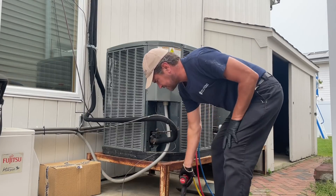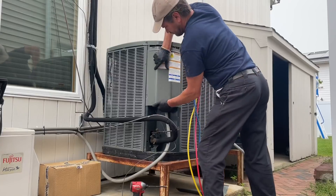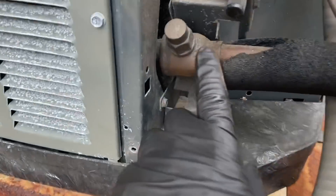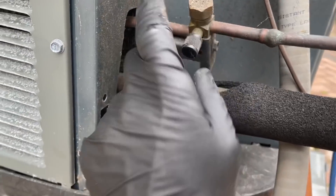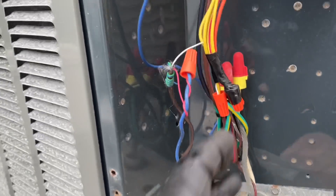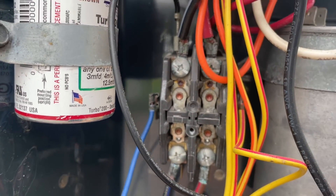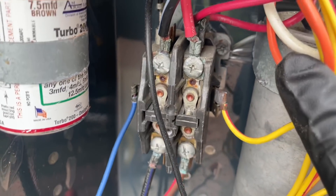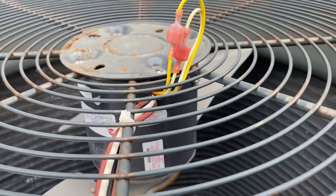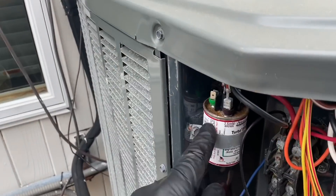Got a little bit of oil residue here — not much — but while I'm at it, let's take a look at the electrical compartment. This is what the salt in the air does. I'm literally about 700 feet from the ocean. You see how the salt in the air eats away everything. AE 2000T heat pump, it's R22. That contactor looks kind of suspect — it's humming a little bit. There's a capacitor. Bet you this was replaced. Yep, sure was. Condenser fan motor was replaced — came from Johnstone.